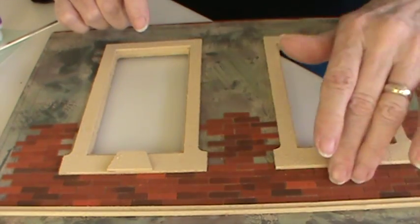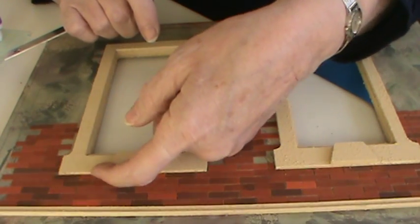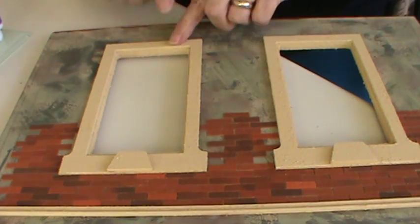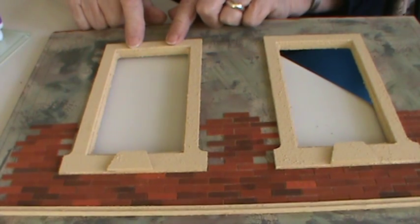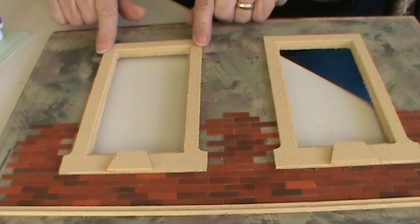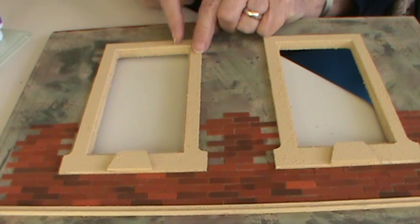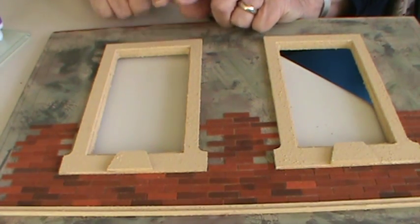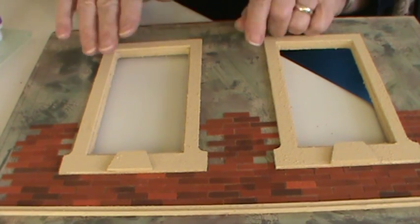Decide where you want a complete row of bricks to be, where it's important to you. Do you want a complete row of bricks sitting on the top of your trim or window, or do you want a complete line sitting underneath your window, which of course would be the normal thing. Doesn't matter so much when there's a trim, but if it was just a blank window, you really could do the complete line of bricks there. Though what I did do on one project, and it looked really nice, was put those vertical bricks in that you often see supporting a window frame. So have a good think before you start where it's important to you that there's a line of bricks.